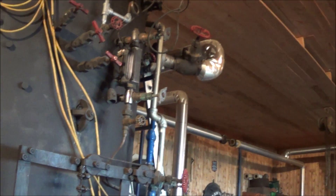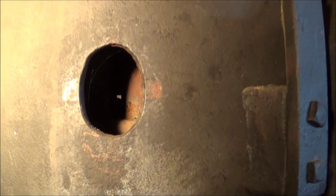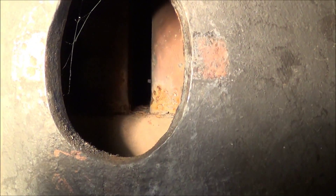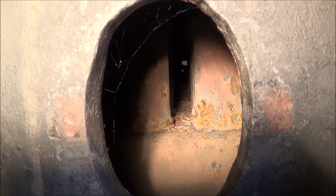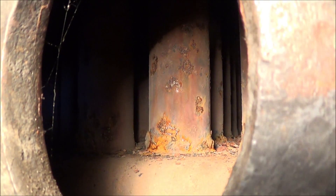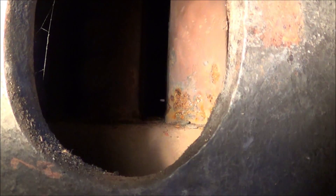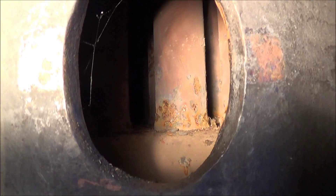Here's a shot you don't see too often. Take a look inside one of the hand holes here. Right on inside you can see the crown sheet for the firebox, and directly across is the hand hole on the other side of the boiler. And all those in there are nothing but tubes. So you can kind of see why they need replacing — getting a little old.